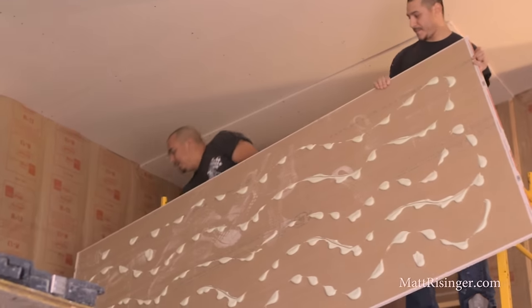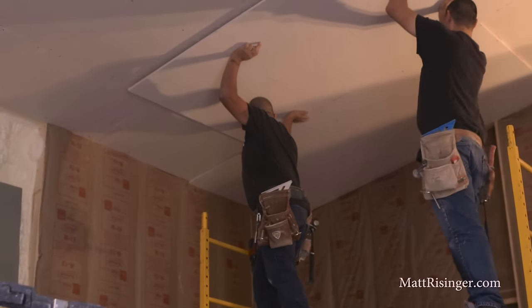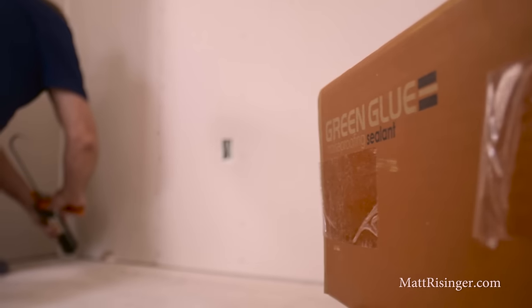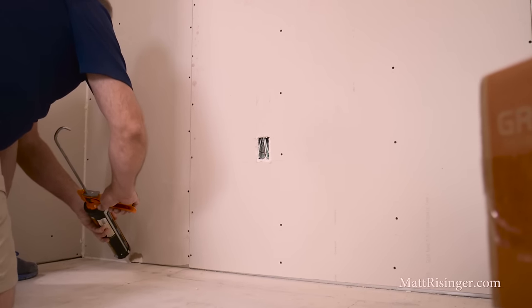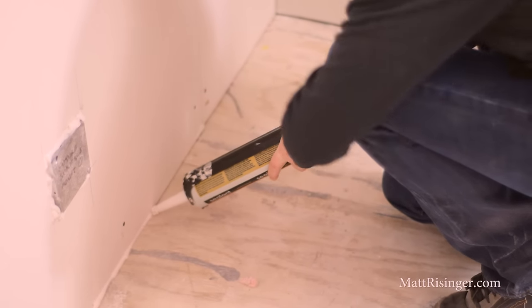In this room, we've got our ceiling done first. We got the walls built, got it insulated, got everything sealed up from the corners, and put the two layers of drywall up with the green glue in between on the ceiling. When ready to do the walls, we put the wall board up a single layer, then come in with acoustic caulk and caulk all of our joints. That keeps the caulk behind the finish layer so it doesn't squeeze out where the painter will be working. We're doing a heavy bead, smearing it in there, making sure it's absolutely airtight — 100% sealed, no bubbles. And when we frame the interior wall, we set the base plate in a bed of that same sealant, then put the drywall on it and caulk it again for double assurance.